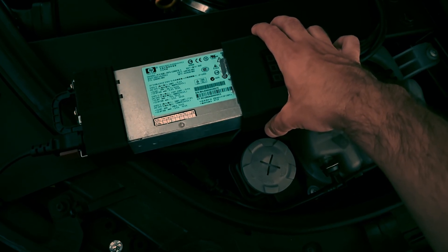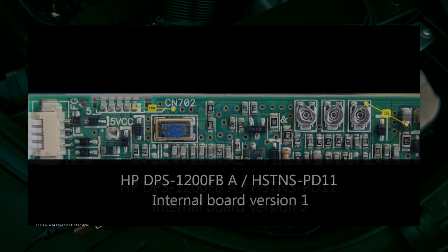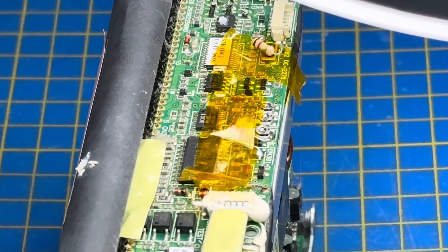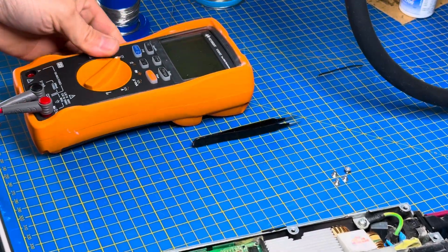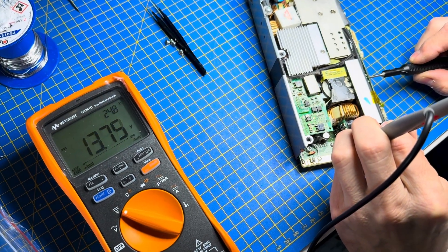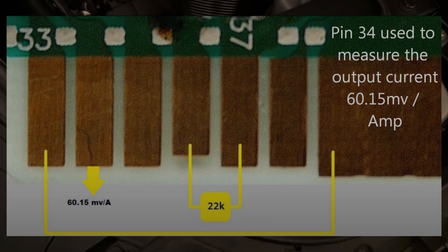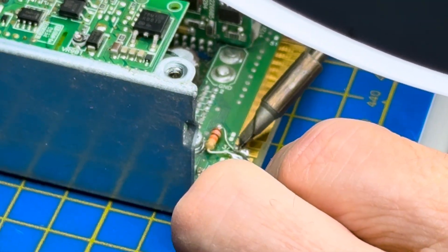We need to solder three resistors. The first one is 110 — or in my case 120 kilo ohms, because I could not find 110. This first resistor will basically disable the overvoltage protection, because the power supply is meant to be used only on 12 volts. The second resistor on this board is 22 kilo ohms, which tricks the power supply into thinking it's producing less than 12 volts, so we can ramp up the voltage using the built-in potentiometer. We also need a resistor and a short circuit from one of the pins to ground, in order to power the supply without a PC.